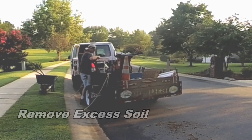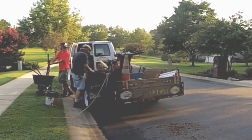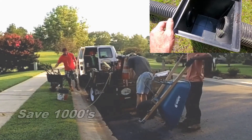Because of the amount of water coming from these yards — remember, I just showed you two yards, but there's actually an entire neighborhood of water that drains and then tries to divert and come between these two houses. So we're going to run the 12 by 12 catch basins rather than the smaller ones.